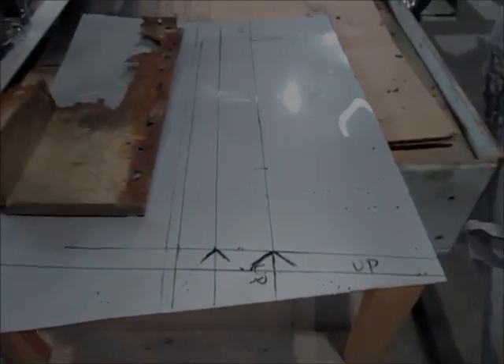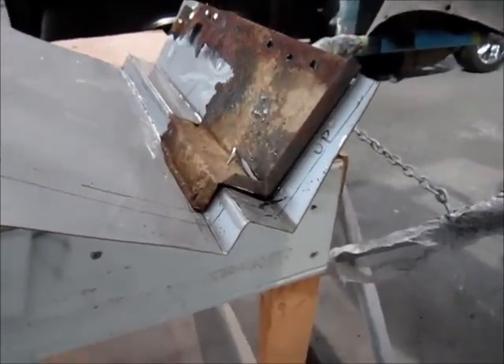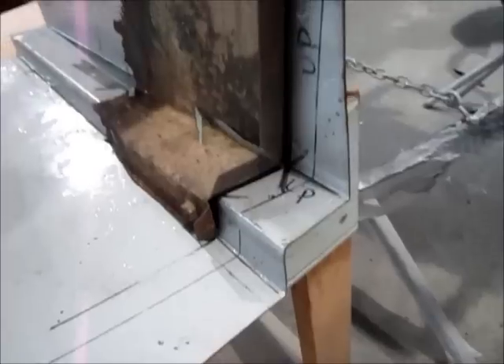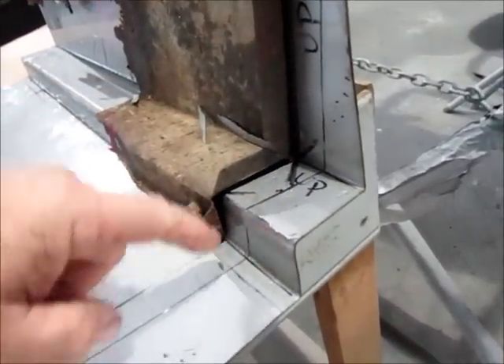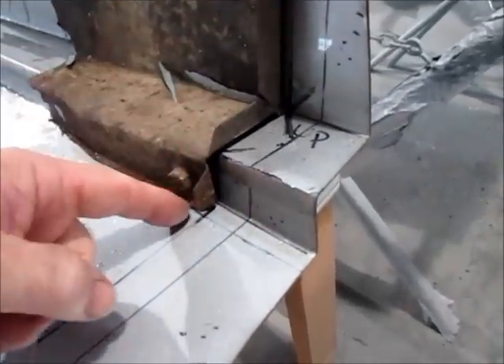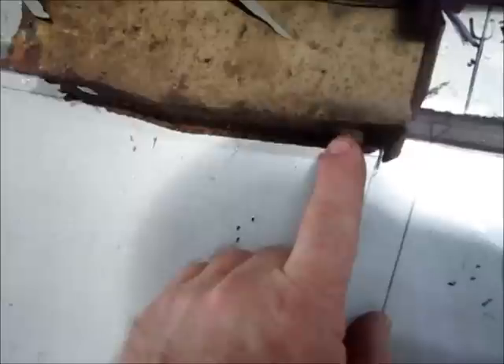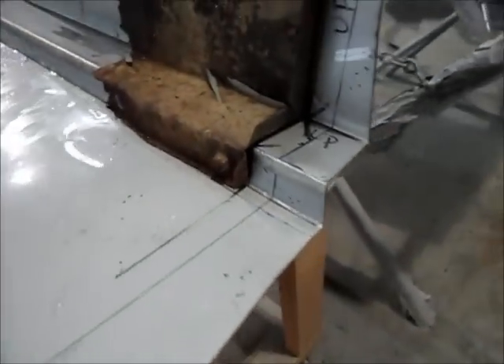There's the basic set of bends — it gives us those three legs. Then I'll cut it on this line right here and bend this to create those legs. The only tricky part is this thing actually has a kind of a joggle to it where it drops down right here, and that's the same thing on the other inner fender. So I may have to get a little creative to make this come back up and create that joggle shape. Getting closer.